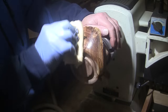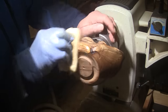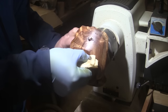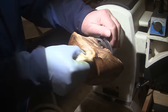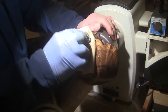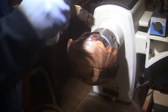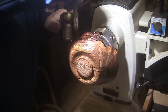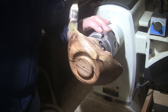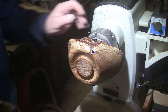After sanding up through 400 grit and finishing the top, I'll put some finish on here — sanding sealer it is. Look at that grain and color — absolutely amazing. This is shellac-based sanding sealer. I will apply two coats of this and then two coats of shellac. I won't show you the shellac because it looks exactly like this — no difference at all. I apply it the same way, comes out of a can ready to use. I'll just brush along the top edge so we don't have to bother it later. It's late now — almost six o'clock — so it'll be tomorrow, but it's gonna look nice.